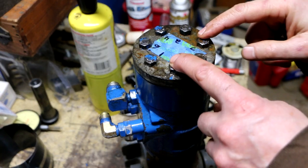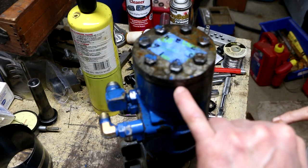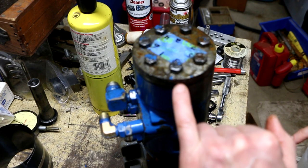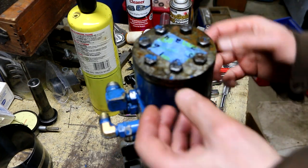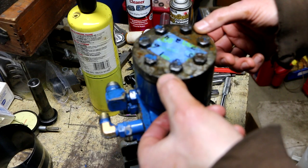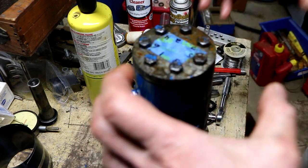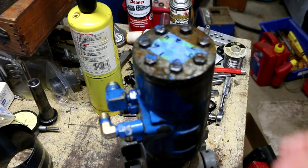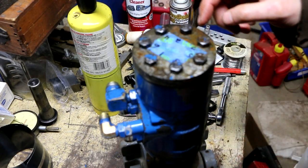Now, I've already started torquing these bolts down. I don't know if you could see it from this angle, but there was a really big space in here, and that was normal, but it gave me pause when I first saw it today. The seal is actually much taller, and it gets squeezed down and compressed, and that actually is what creates that sealing action.